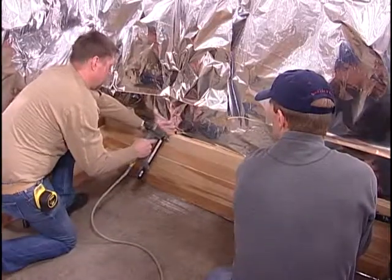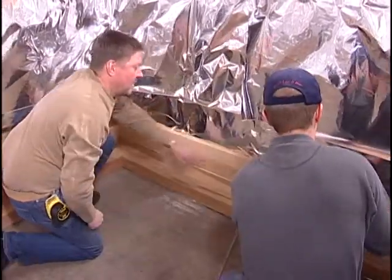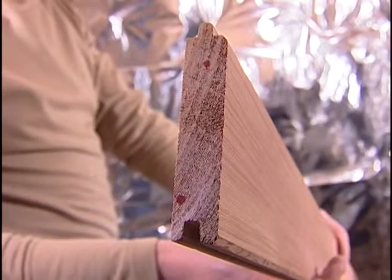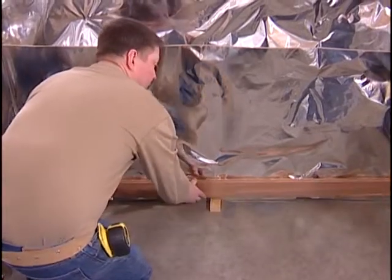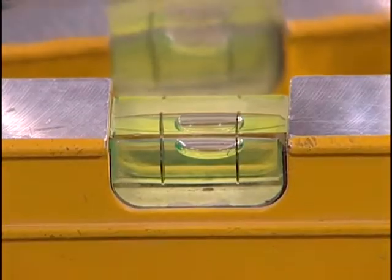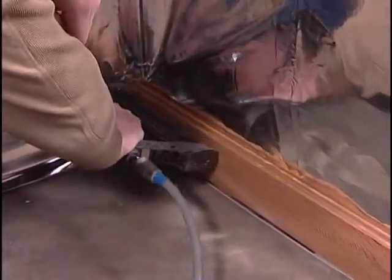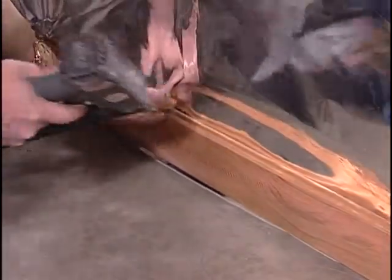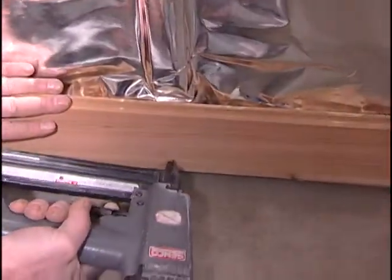With the standard tongue and groove horizontal installation, wall boards are installed horizontally, layer by layer, around the room. Start by installing the first back wall board marked by 2 dots, tongue side up and smooth side out. Raise the board 3/4 inch off the floor and level it. Once level, you may face nail the first back wall board at the ends, and also nail the first layer of boards at the bottom to the studs. Then nail through the studs.